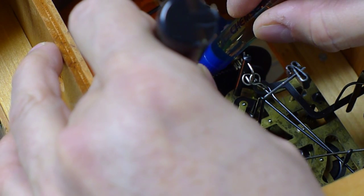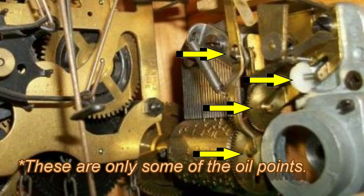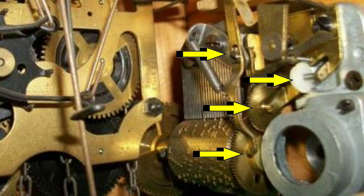And I'm using a flashlight to facilitate that. And that's difficult to do, so blot the excess oil off. There's one more in the front that I don't think you can get access to, and I'll try in a little bit. Then we have the music box - oiling the music box mechanism. These arrows are example areas where you want to make sure you oil: all the gear shafts and pins, rotating parts, etc. It's supposed to be a moving part.